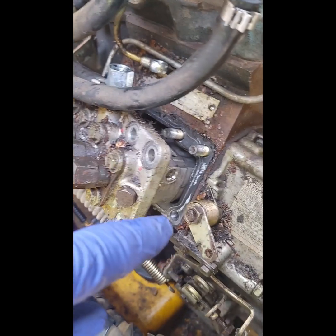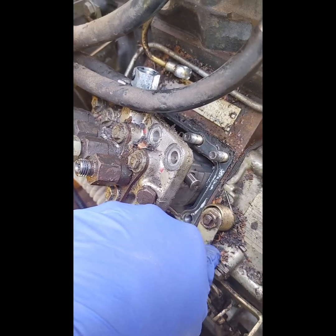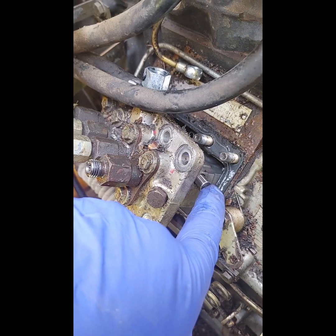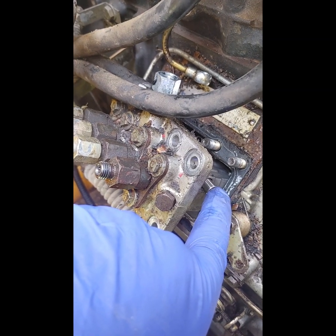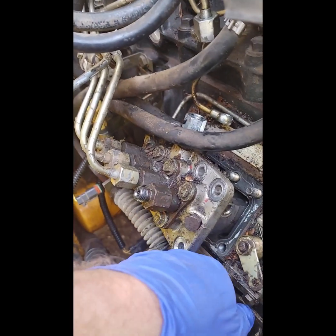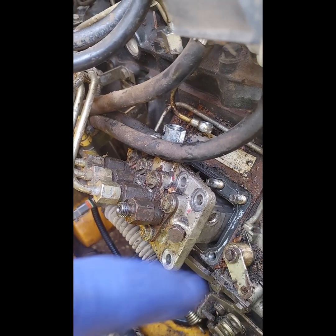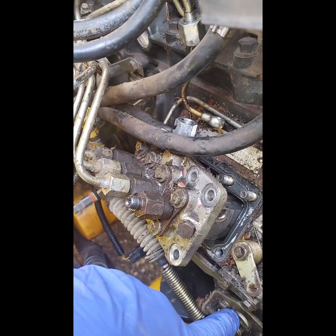So I just wanted to show, there's the end of that rod I'm talking about. Watch when I push this manual stop, that pushes this rod out, that brings it to the no fuel position. And what's happening is, while it's running, something is causing this to go back in here and killing the engine. So that's full on position there. I also noticed that activating the throttle doesn't affect that, so that's interesting, because the throttle's probably working in conjunction with the governor, and when the engine's not running, that's probably why it's not having any effect.